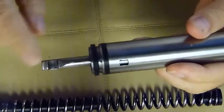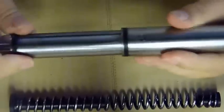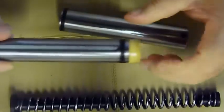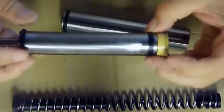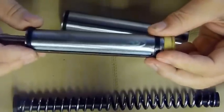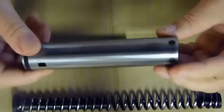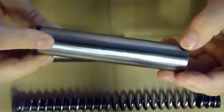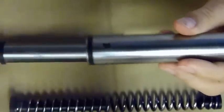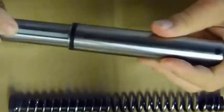That's a 10mm longer latch rod, again made by Paul. The piston itself is fitted with a Delrin piston ring at the front and a wider Delrin piston ring at the back, so it meets perfectly with the actual body of the gun. The compression tube is buttoned all the way around the bottom at the front, and it's got a Delrin piston ring at the back. What that adds up to is no metal-to-metal contact whatsoever during the firing cycle.